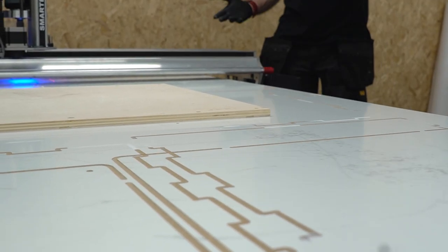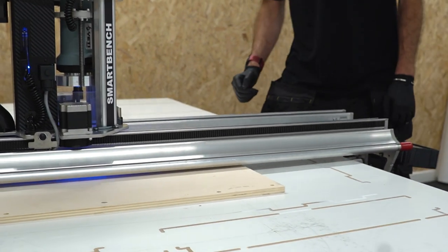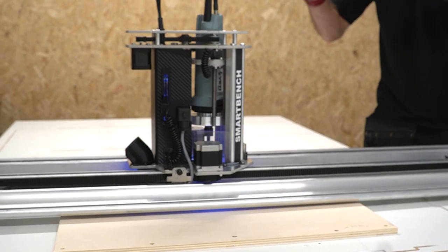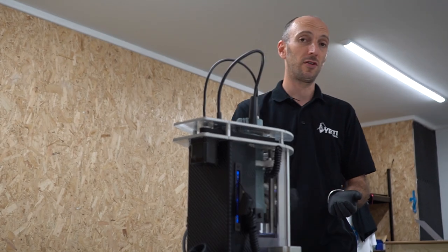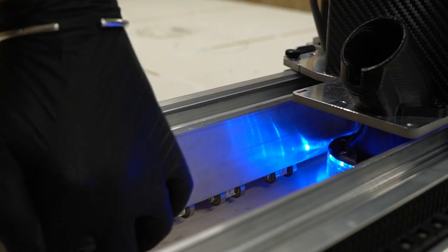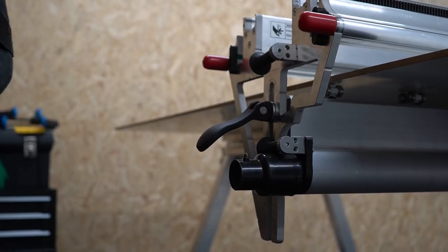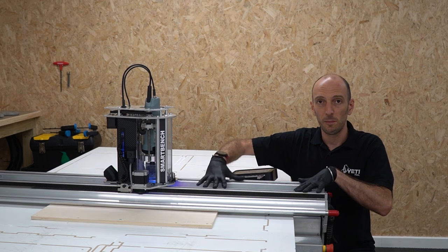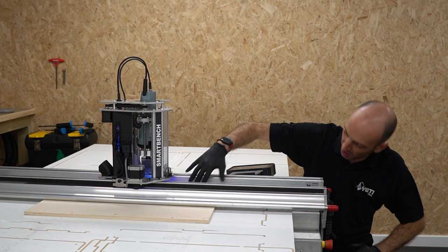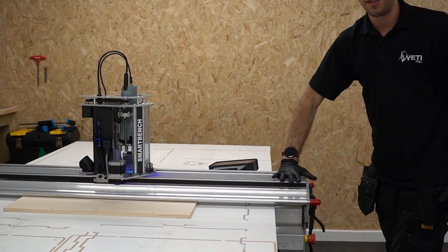I'm going to position the beam over the stock using manual move. As the beam approaches the stock, check that it will clear it and clamp it higher if necessary. I'll make sure the Z head is in the middle of the beam so that when I lower it we have even pressure distribution. Before dropping the upper beam down I'll reposition the bearings on the lower surface of the upper beam so they're all over the stock as much as possible. Once the beam is down I'll check that all bearings are sitting evenly on the stock surface. As I lock off I'm not applying any downward force on the end of the beam.